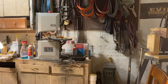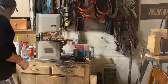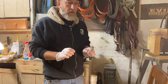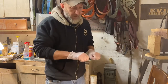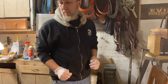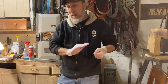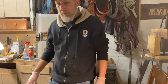Thanks for watching — that was our hand sanding tutorial. One other handy-dandy tip I thought of while sanding: don't try to sand the whole blade at one time, just do little sections at a time. Your sandpaper will wear out faster if you're trying to sand the whole thing, as opposed to just working a couple of little sections — maybe an inch or two at a time. Get those cleaned up, move forward, move forward — that seems to work better. Buy good sandpaper, have a sanding block, and attach your knife firmly so it's not flopping around. You can't hold it in your hand and hand sand it.